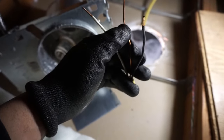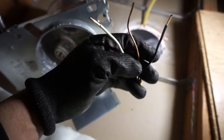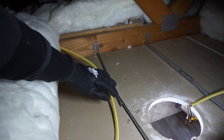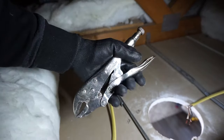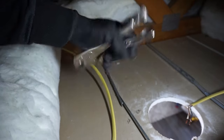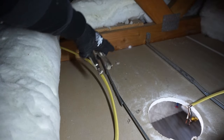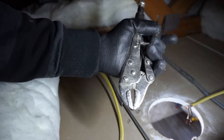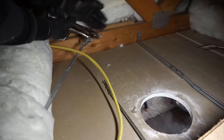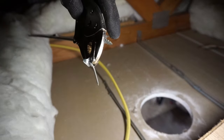When it's time, I'll connect the remaining lights with this power source. I'm going to be taking off these railings. The tool I like to use for this is vice grips, because the rail is nailed onto the beams — vice grips make it a lot easier. It just yanks the nail right off.